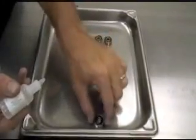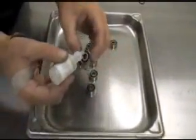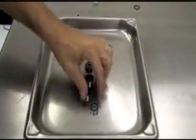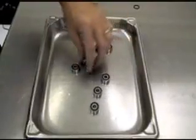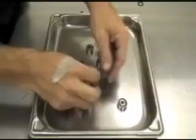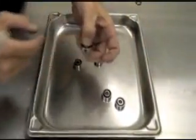This is an important step that I do to all my bearings. Remember not to squirt any oil in the bearing, just moisten the back of the ball cage. That's the trick. After you're done wetting the back of the retainer, pick up the bearing and work in the lube. This will get the lubrication into the working mechanisms.